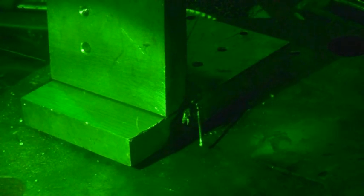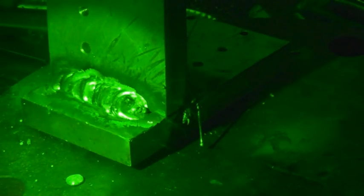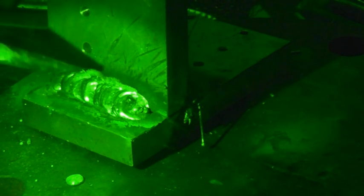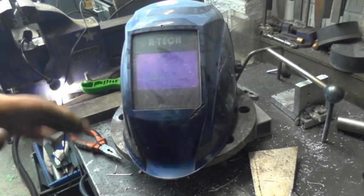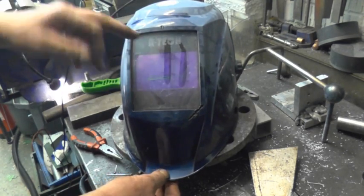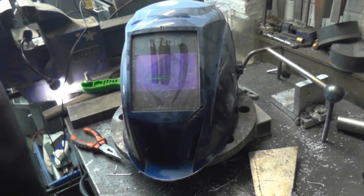This is 16mm plate. I've got the wire feed maxed out on the welder with 1.2mm wire and the voltage at about 70% — that's as much as the wire will take. That really is burning in there. It's quite a decent weld. The weld is nice and clean, with a little bit of black soot either side, but right next to the weld you can see a light grey colour where it's actually cleaned itself. One thing I have found with welding aluminium with a MIG — you do need ventilation, some horrible fumes come off it, especially when you start to get the amps cranked up.